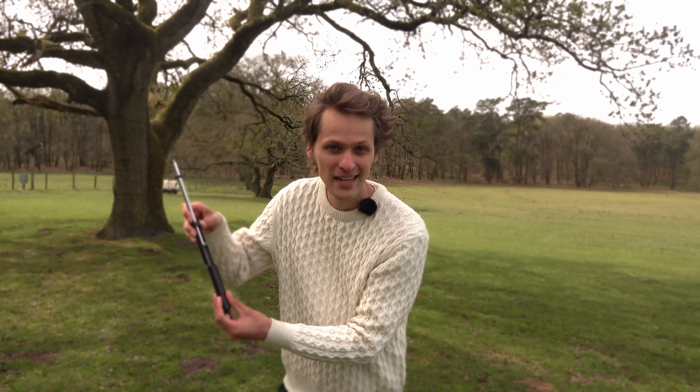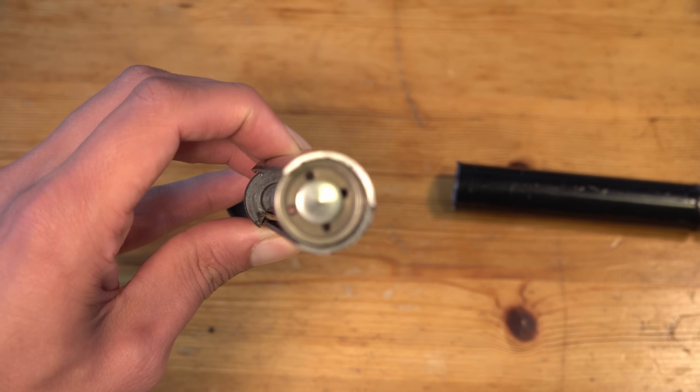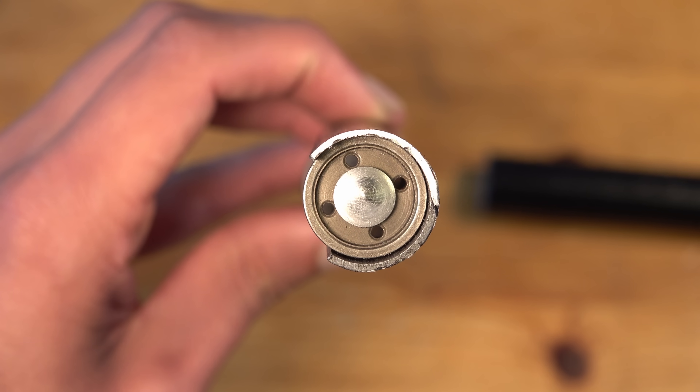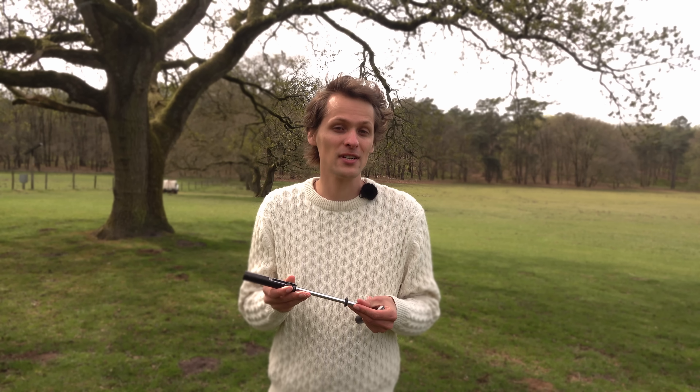This beautiful thing is just a sealed cylinder with a rod - very similar to the cylinder from the office chair, but without the valve. The chambers on both sides of the piston are permanently connected. The piston is basically just a spacer, because it has holes going through it to equalise the pressure on both sides. Sometimes it's a slot on the side of the cylinder wall instead, as this old Tony shows in his amazing video on constant force gas springs. The size of the holes, slot or valve, in relation to the viscosity of the fluid inside the cylinder, determines the speed at which it can move.